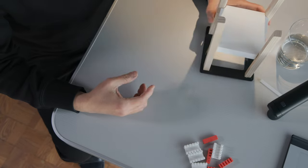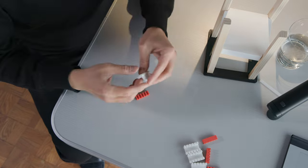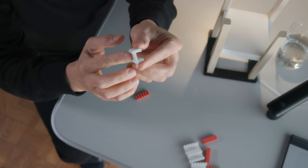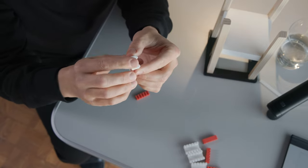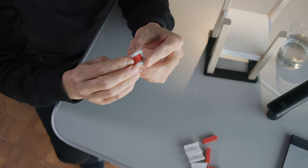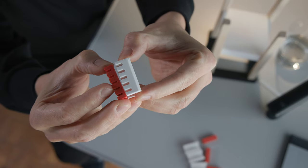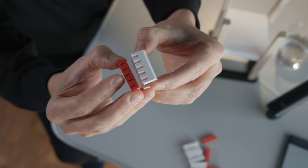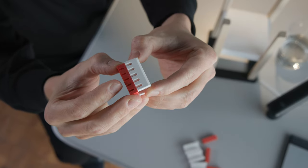So while this is cooling down, let's talk about how I would like to keep the PCBs in place. It's a very similar idea in that I would like to have a part that registers against the inside edge of the rail — basically like a clamp. This would be the fixed jaw of the clamp and this would be the moving jaw, and they go together like this. You can see they have these slots on the sides, which are a little bit thicker than a PCB. I'm assuming 1.6 millimeter PCBs and the slots are going to be 2 millimeters wide with a 5 millimeter spacing.